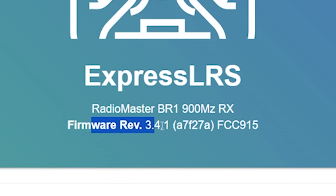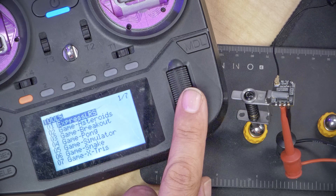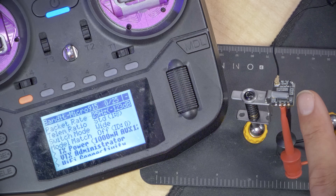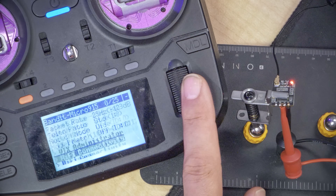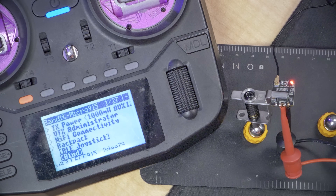If you don't already know how to do that, go ahead and pause this video, go watch that video — I'll put a link in the video description below. The receiver has now been flashed to firmware 3.4.1. And you might think the next thing we would do is demonstrate how that wonderful bind button works. But it's not quite that simple. This receiver is factory fresh — it's never been bound before, and it will boot into binding mode automatically, bypassing the need to use the button. So all I have to do to bind this receiver is go into my ExpressLRS Lua script. Notice that the receiver is automatically going into binding mode — a double red blink on the LED. I go down to the bind option, and voilà, it's bound.